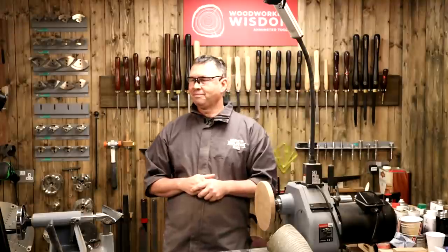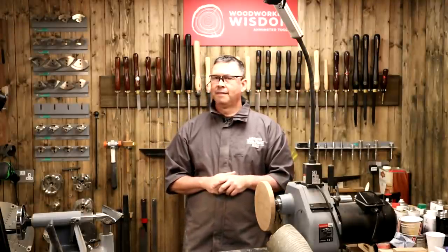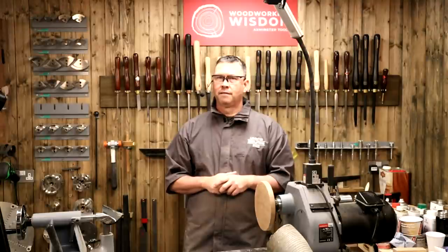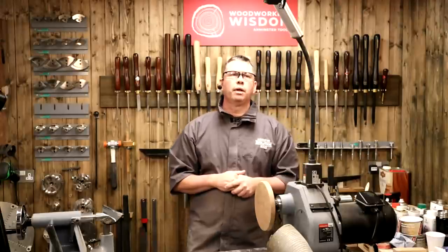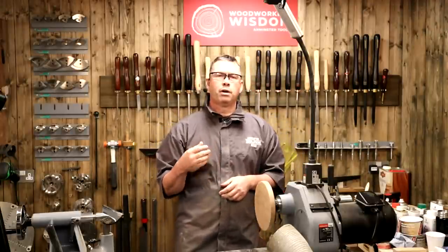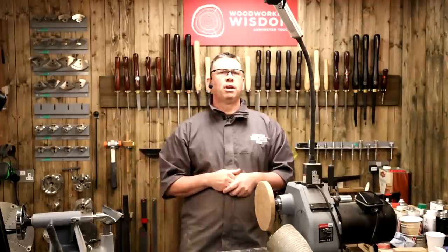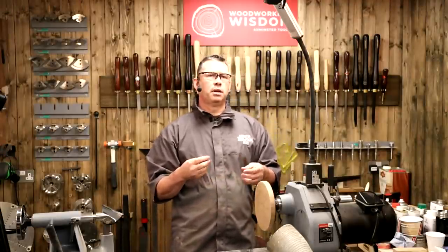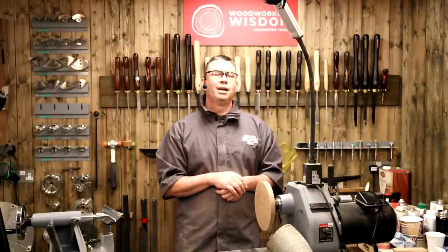Okay. One more question from Callum this time. Been using Yorkshire grit. Is it okay to use friction polish after? Yeah, there's no reason why not. I'm guessing because you want to have a higher shine. They battle with each other a little bit. Yorkshire grit is like an abrasive. It's suspended in the wax. So that's going to give you a nice high shine.